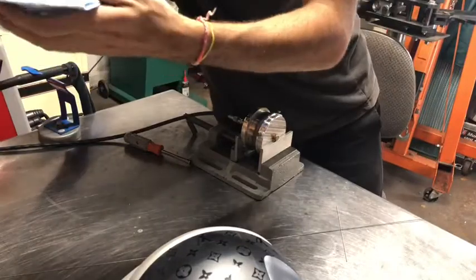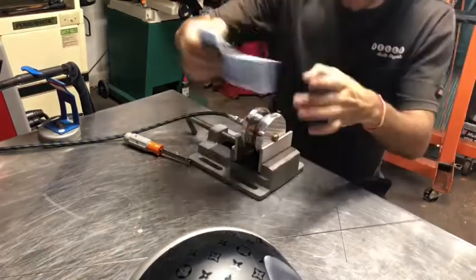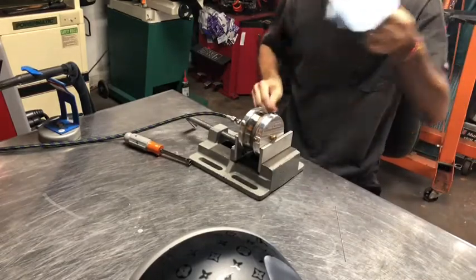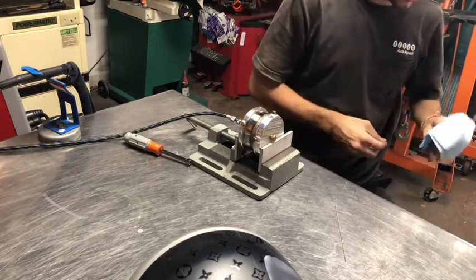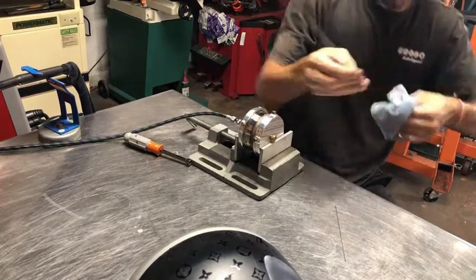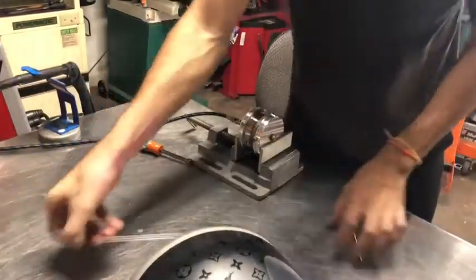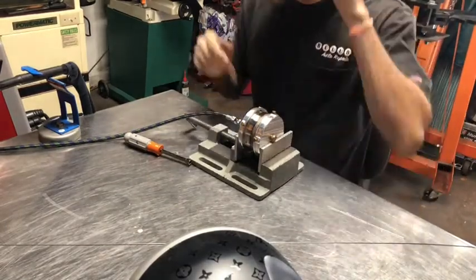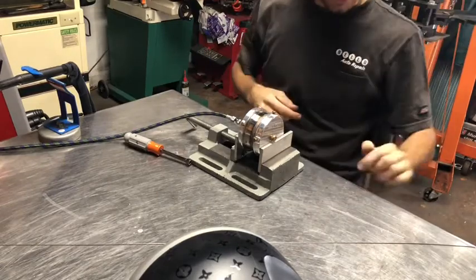Just got another piece of wire and some acetone to do a quick wipe of the joint — I already did this but just as another precaution. Wipe your filler rod too. I always make a habit of wiping it, especially on aluminum and titanium. This is stainless filler, 3/64 diameter.